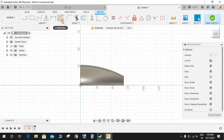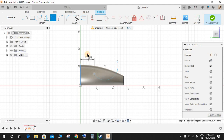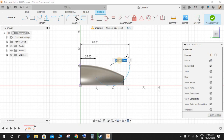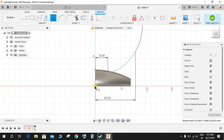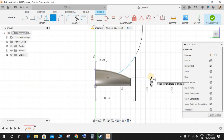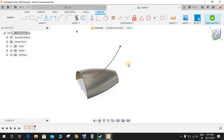Click on 'Create a Sketch' again and on this plane create a sketch. Go to three-point arc and make an arc. Press D again: from this point to this point make this distance 25 mm; from this point to this point it is going to be 80 mm; the radius of the arc is 90 mm. Drag it upwards, press D again, and from this point to this point this dimension is 15 mm, and this point to this point is 60. Your sketch is now fully constrained.